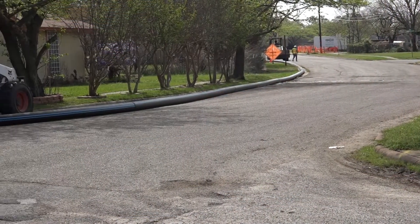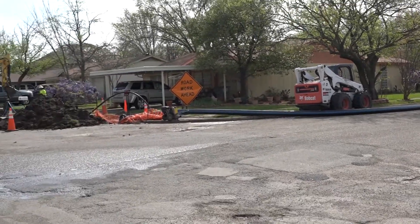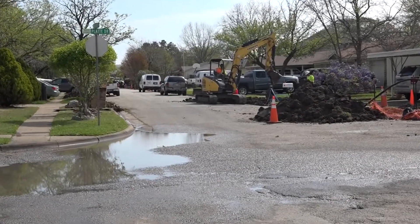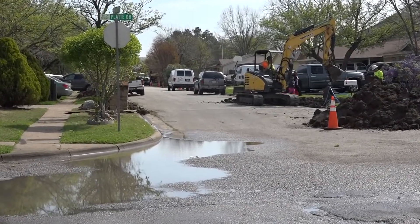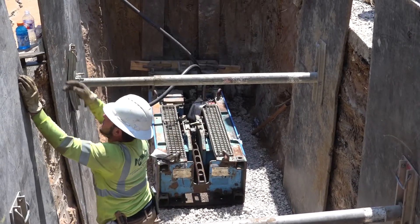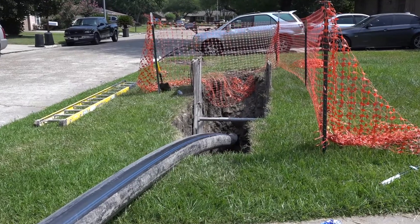We have reduced social impacts — there's minimal impact to businesses, residences, schools, and traffic flow. It's a customer-focused method, so it's less inconvenience during construction time. By utilizing the existing water main alignment, we have no conflicts with other franchise utilities. It eliminates identifying new easements, reduces third-party relocation costs, and there's reduced infrastructure so we're not taking up more area within our right-of-way and under our streets. The minimal design and no-survey approach results in 8 to 10 percent cost savings versus traditional open-cut design.